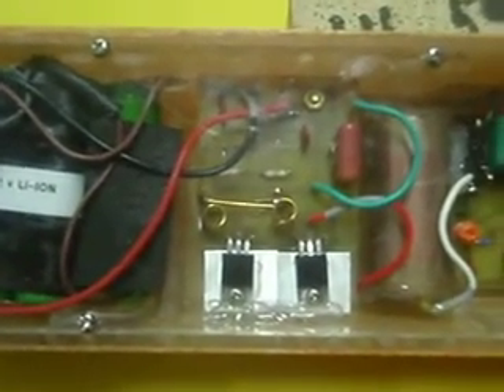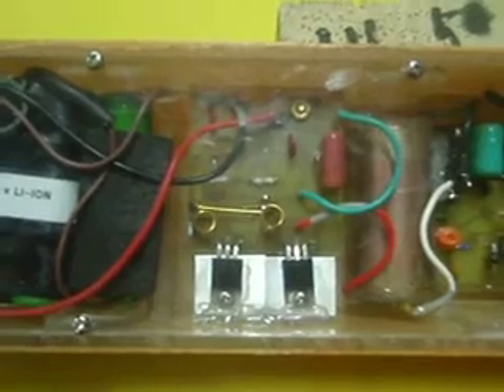Hello my friends from YouTube. In this video I would like to present you basically a multi-stage power supply arranged so that each succeeding stage multiplies the voltage produced by the preceding stage. The final stage of the circuit feeds the output transformer, and the first stage is the power supply made out of the well-known timer NE555 and two fat transistors connected in parallel.